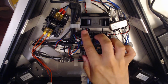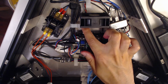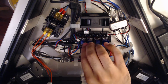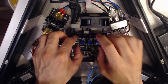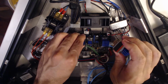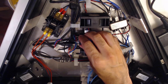Okay, I think this might actually be getting enough airflow from the fan. The fan's obviously round, right? So in the center portion of the fan, there's definitely air coming to this area. The question is, because this is sitting slightly above center, how much of that air is going to come. I'm going to swap this one and this one, because the heatsink on this one is placed slightly right to that one, so it gives us a bit more chance of airflow getting there.